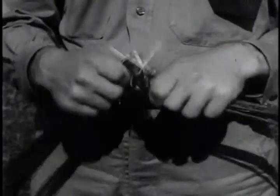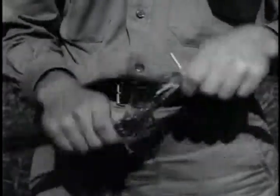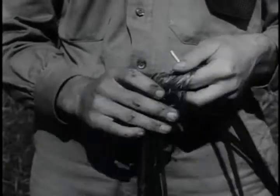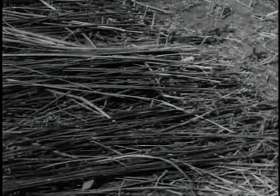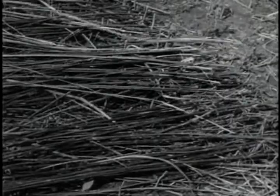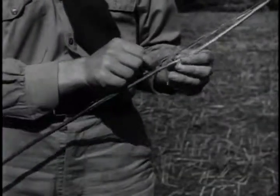When the woody core breaks away readily, like this, the hemp is about ready to take up and bind into bundles. Well-retted hemp is light to dark gray. The fiber tends to pull away from the stalk. The presence of stalks in the bowstring stage indicates that retting is well underway.